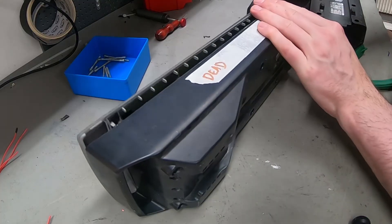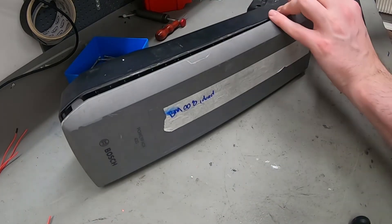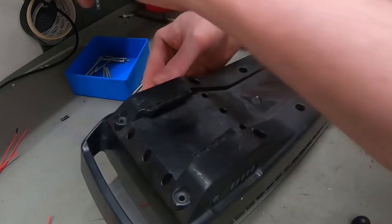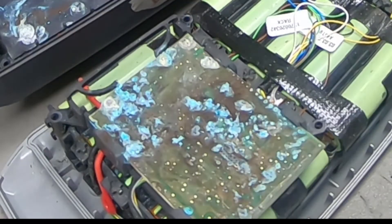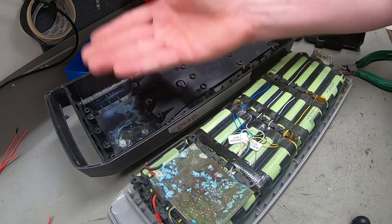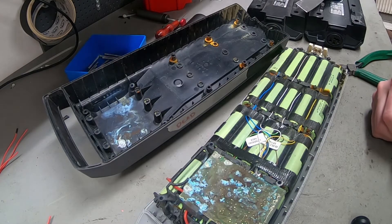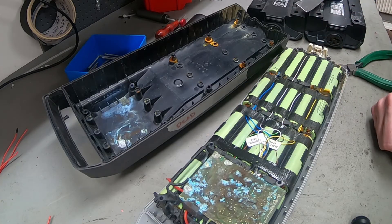They don't have any prongs, but they had some silicone. There's a PF cell in here. Bosch has their BMS down at the bottom, so all the water comes down here and has a pool party. Some other battery manufacturers place the BMS upside down at the top like a bat cave — that might damage the cells but protect the BMS. This one will not be refurbished. I'm thinking about getting an ultrasonic cleaner and trying to clean up these types of boards to see how pretty they can get, but we will never get this working again because every single component is gone.